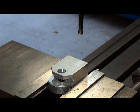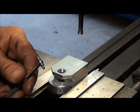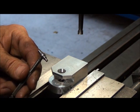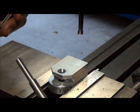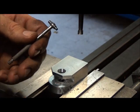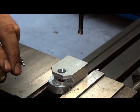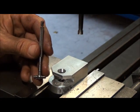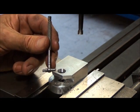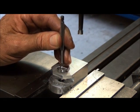So we're at 494. How else can we measure this hole? There's a third option — a telescoping gauge. These come in sets ranging from about 5/16ths in diameter up to about 6 inches, so they have a lot more range than a set of small hole gauges. In this range they're pretty comparable as far as accuracy goes. The difference is how you use this tool — you do not use it like a small hole gauge. You don't line it up on the center line and feel your way into it. This is done differently.